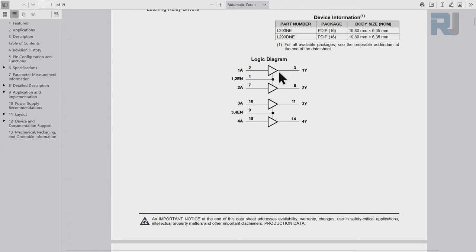To control a motor we just need two lines. We set motor pin 1A as HIGH and pin 2A LOW - the motor runs in one direction for 2000 milliseconds. Then we set motor 1A LOW and motor 2A HIGH - the motor rotates the other direction for two seconds. When both 1A and 2A are LOW, the motor stops for three seconds. Then the loop repeats all these actions.